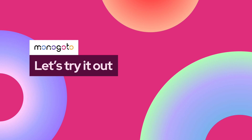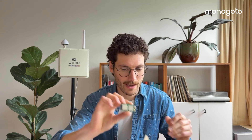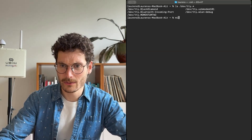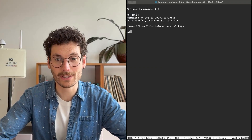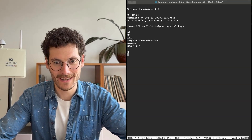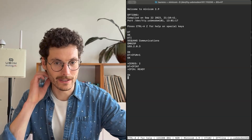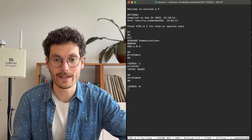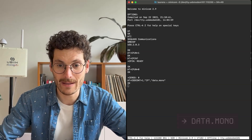We can see that the radio is up and running, but let's try it out ourselves. I'm going to connect the Monogoto SIM and connect the cable, hooking the device up. Let's open the serial monitor and check what serial port the device is connected to. We'll use Minicom to open up this serial connection. We're connected to the Walter board — let's see if it responds to an AT command. It does. Let's request some board information, enable the radio, then request whether the device recognizes the SIM — and that is the case. To configure the device, we disable the radio, define the APN settings as 'data.mono', then enable the radio again, allowing the device to connect to potential networks.